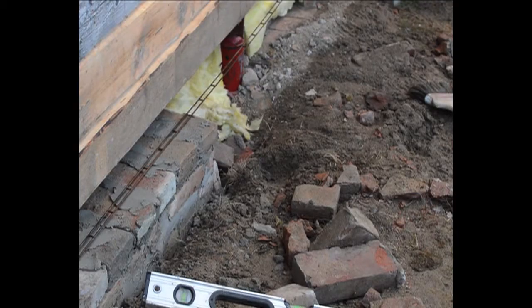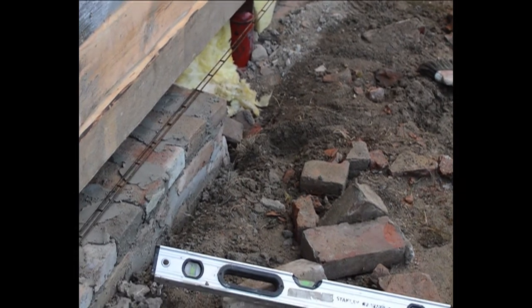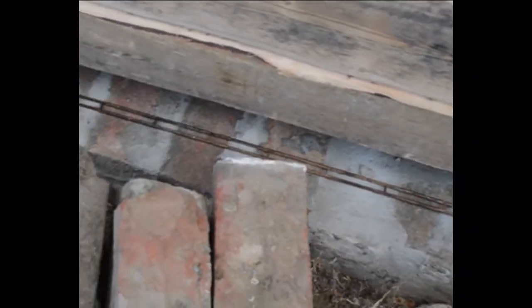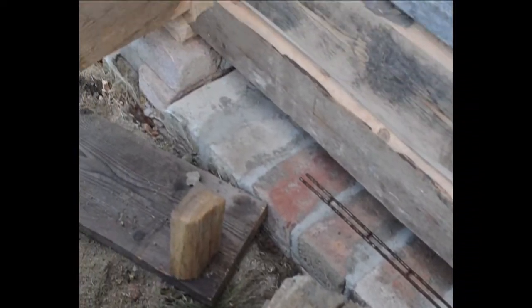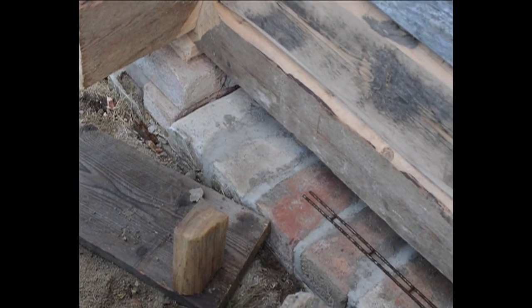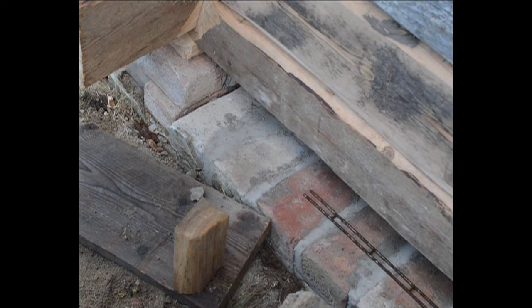I'm using a very lime rich mortar. It's like a kind of restoration mortar. But because I'm going for this stronger mortar on top of the weaker clay, I mean, it's been done with clay previously. It might have had some lime in it, but I don't really think so, because the clay that I've taken out has turned back into clay.